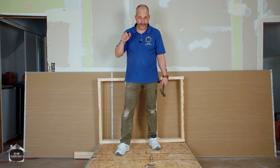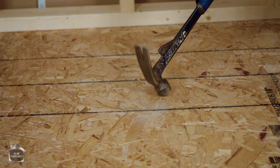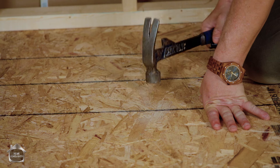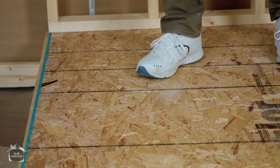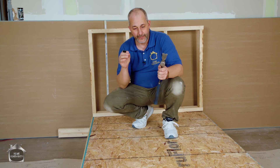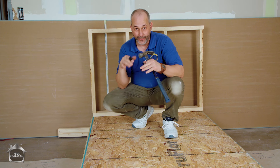Amazing how just a little bit of movement causes such an irritating sound. Today we're going to show you how to get rid of your floor squeaks once and for all and how they started in the first place. When you see a squeak, everyone clicks to find that nail that needs to be embedded - problem solved, right? But watch what happens as soon as you get up: how come the nail doesn't stay down? I'm going to help you understand your floors and how your house is built so you know what to do to stop this from reoccurring, because if you want to install a new floor and you can't stop your squeaks, you've got no business moving forward.